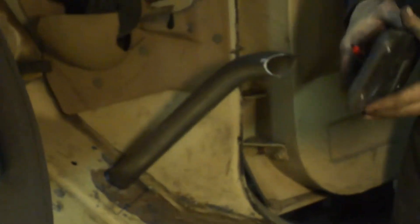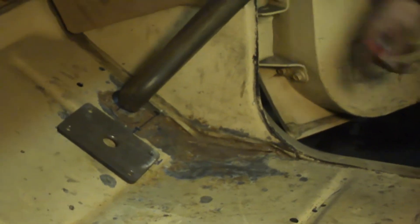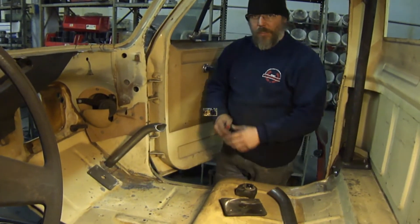When you actually make the cut, you need to take an extra quarter of an inch off for your floor plate, because you've got to get your floor plate back under there. That'll slide back under there when you're ready to weld things into place. We're going to go ahead and get that tube cut, fit it up, get it tacked in place, and then we'll show you.